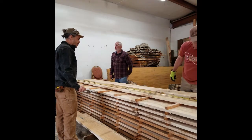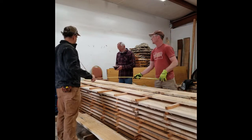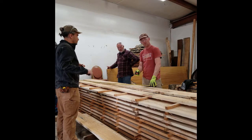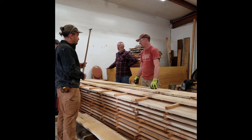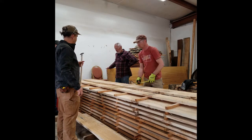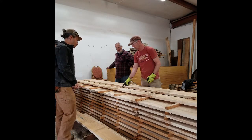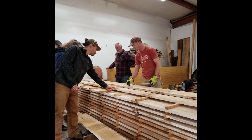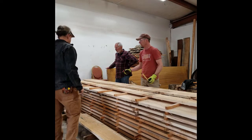So this is a 12-foot board, but it's 12'8". So this is a 12'8" board. So we call it a 12-board. Okay. So there's 3 8-inches or something on there. So since the board is 6 inches wide, you would use this, and without using a tape measure, this tells you that. You put it on 12. It's a 6-inch board, so it has a surface measure of 6. So we call it, it's like square footage.